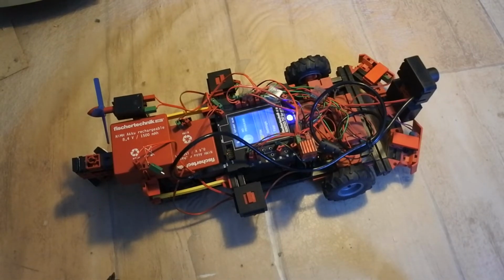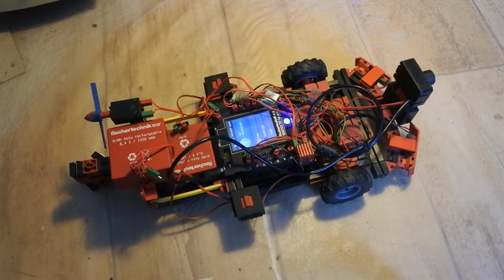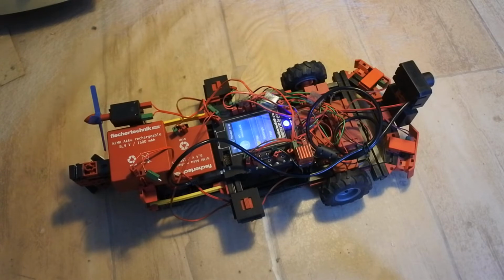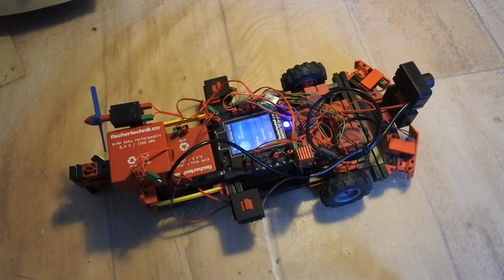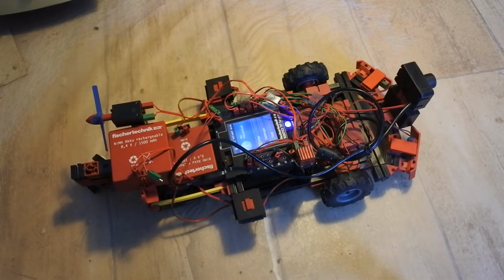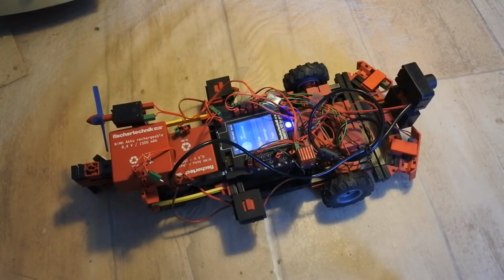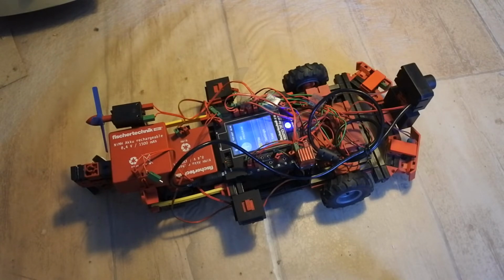This video is focused on my driving robot discovery based on the TXT controller from fischertechnik. That means the whole robot is made of fischertechnik, powered by two battery packs which can be independently switched on and off. It is equipped with two front sensors, here and here, an active sonar, and a USB camera for grabbing images using OpenCV. Also a propeller indicates whether the algorithm is still running, and the algorithm for this project is written in Python using the F2RoboPy API, driver or library.